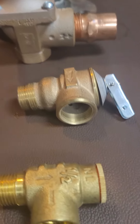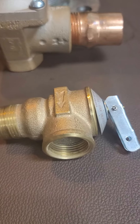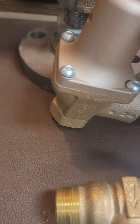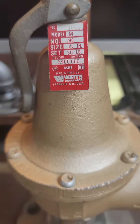These are pressure relief valves. This one is for a well and opens at 100 psi. That one is for a tankless water heater — again, pressure only. This one opens at 200,000 BTUs and these are for boilers. This one has a much higher rating — you can see it's nearly a million BTUs. And this big one right here is almost 3 million BTUs.